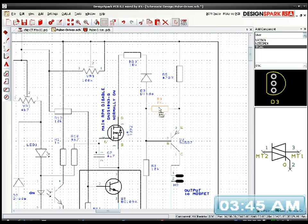Because it'll be as if this resistor wasn't even there. No, sorry. No, it will. That resistor is the pull down for the emitter base on the PNP, so that will be there, but it'll be as if this and this out there, that's what I was trying to say, these two effectively will be ignored, because there won't be a circuit through here, it'll just be dead. So the soft starter only works when you first power it up, basically. I think I've got it sussed, finally.